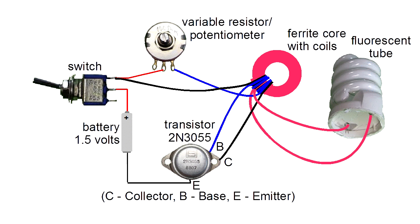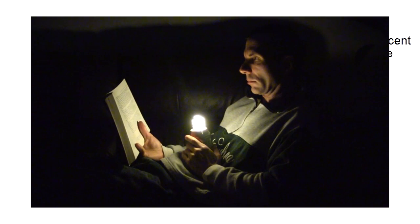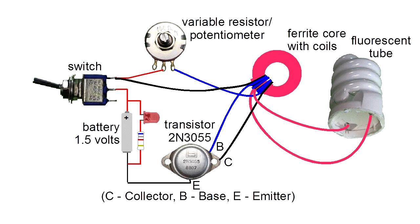It's almost the same circuit as this Joule thief circuit I used to power this compact fluorescent light bulb. There's just an LED and current limiting resistor added to tell you when it's turned on, and on the output there's a diode to turn the output into DC, and a capacitor for smoothing. There's also a bleed resistor to get rid of the high voltage when it's turned off, plus another resistor right here. But other than the LED and the modification to the output, they're both the same blocking oscillator circuit.